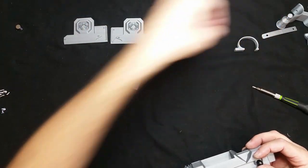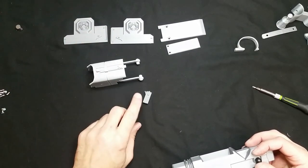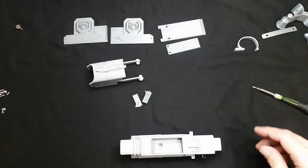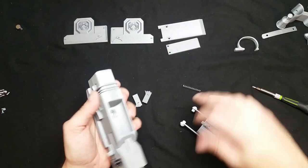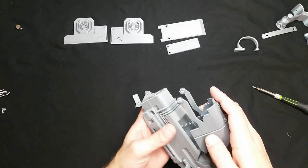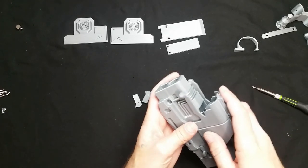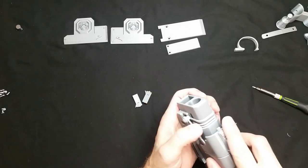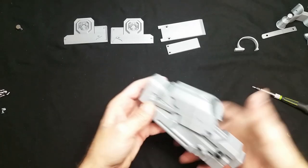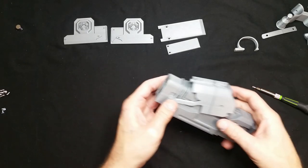All right, these two little dudes right there. We need the chamber. These are kind of the little retainers that go on the sides of this. And we need a spring. Basically, all you have to do is set the spring down in the hole, and on the bottom, there's a matching hole. Now I've got the spring sitting in both holes. Go at an angle and just pull these two arms apart and make sure that moves good. And if you want to, you can clip it down. Okay, so we're good there.